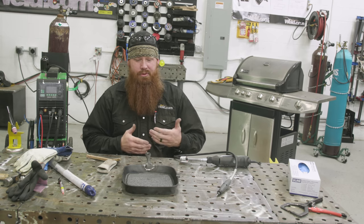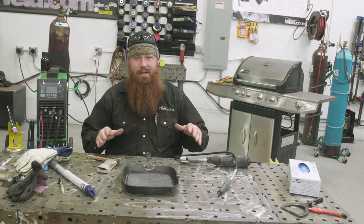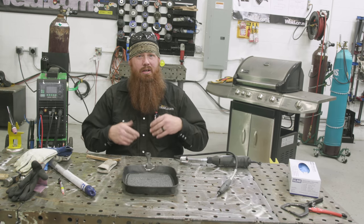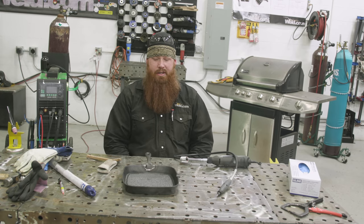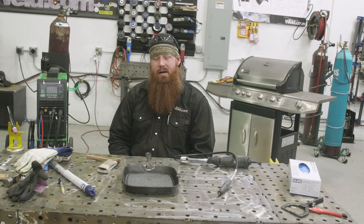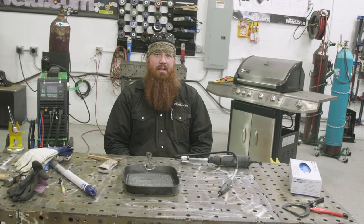There are plenty of other ways to do your post heating. If you're just using charcoal briquettes, you can leave it in there overnight with the lid on and let it completely burn down. You want it to cool uniformly and slowly — don't quench it, don't hit it with air, just let it cool down slowly. That pretty much concludes it, guys. Hope you enjoyed it and learned something. There are a bunch of different ways to do cast iron, so if you have a different process drop it in the comments. We appreciate you watching — don't forget to like and subscribe, follow us on Facebook and Instagram. Until next time, make every weld better than your last.